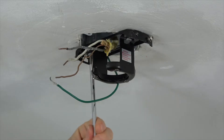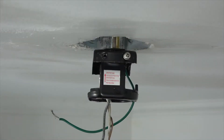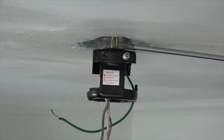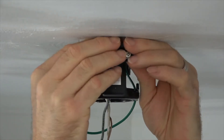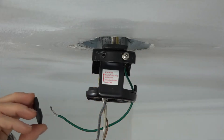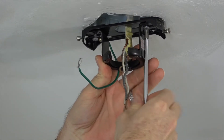Before installing the rubber spacers, you'll need to loosen the screws holding the mounting bracket to the outlet box — loosen but do not remove those two screws. Once loosened, remove the adhesive backing off of one of the rubber spacers. You'll notice a slot in the center of the rubber spacer that will go on either side of the screw in the outlet box. Slide the rubber spacer between the mounting bracket and ceiling so the adhesive side faces towards the mounting bracket, then press it to the bracket so it sticks. Repeat this process for the other side. Once both rubber spacers are placed, completely tighten both outlet box screws to secure the mounting bracket to the ceiling.